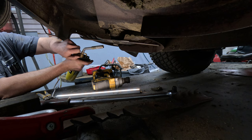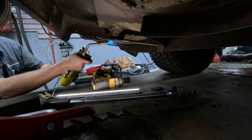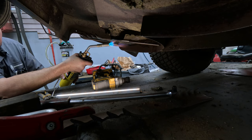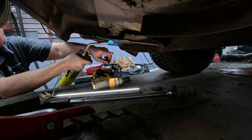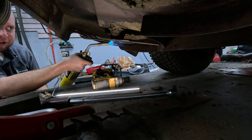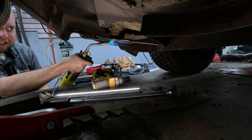What I'm going to do is go ahead and heat it up. We're just heating up the nut at this point. You want to try not to heat from the bottom up — you don't want that shaft to get hot as quickly as the nut does.